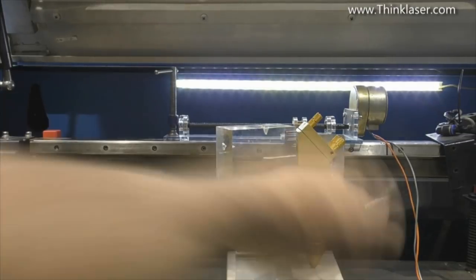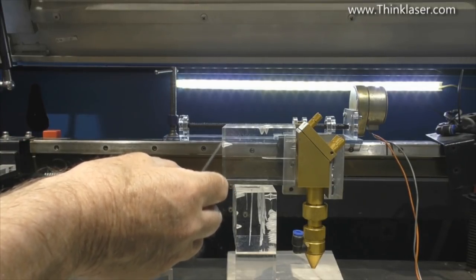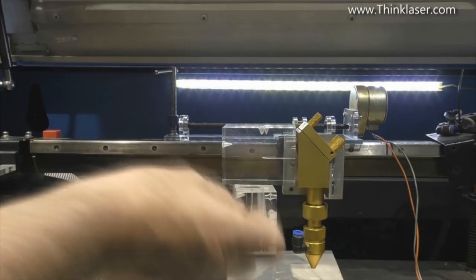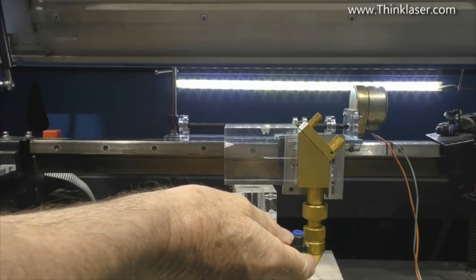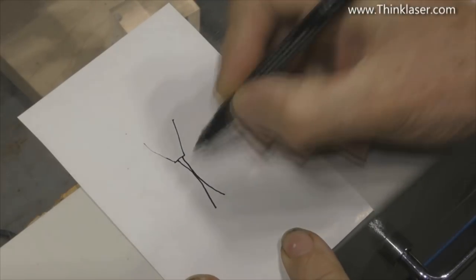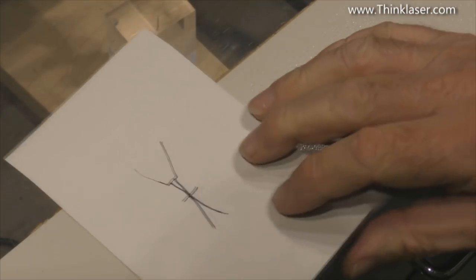It took a long time for the liquid to form around the outside of this cone - that's the low-energy side of the beam. The only difference between this side and the other side is that this shape is about 6mm diameter here but only about 0.2mm diameter when it comes out of the nozzle. So there's a big energy amplification difference. The beam comes out the nozzle, the focus sends it down to a focus point, and that's where we get the smallest possible beam - after that it starts expanding quite rapidly.